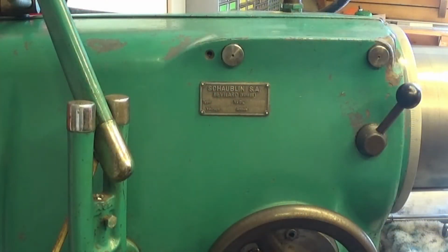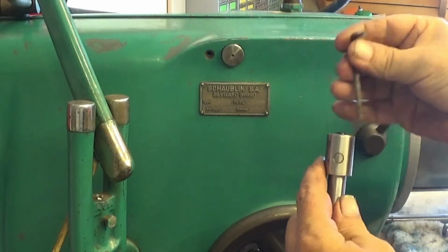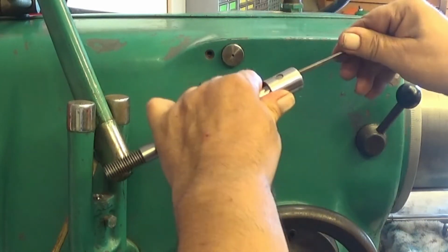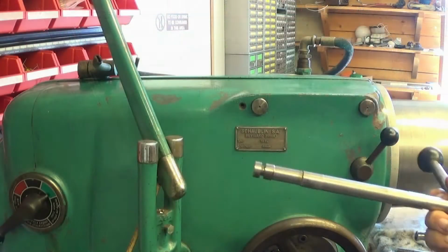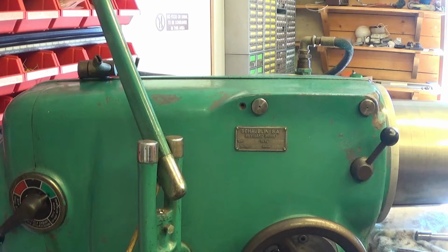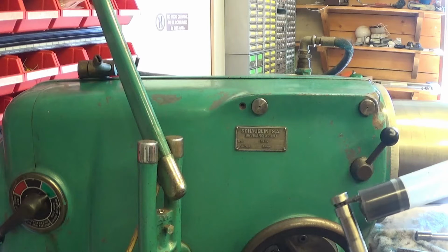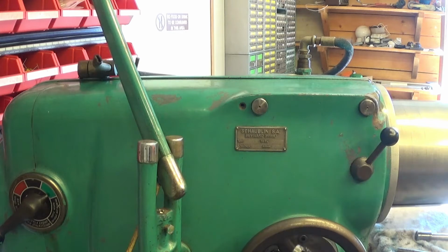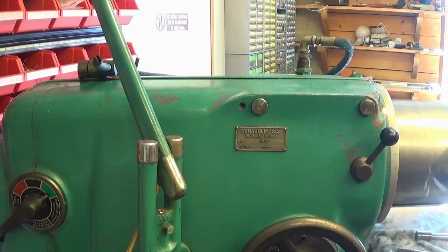Okay, then we have these specific bolts which have a very nice locking mechanism here. You take an Allen screw here, there, and then it will lift that one up. And then we have this. This is the eccentric, and this one, there is a set screw which goes to this groove. I will put some grease there, and then we have this face which is the bearing. So then we put this in from here.